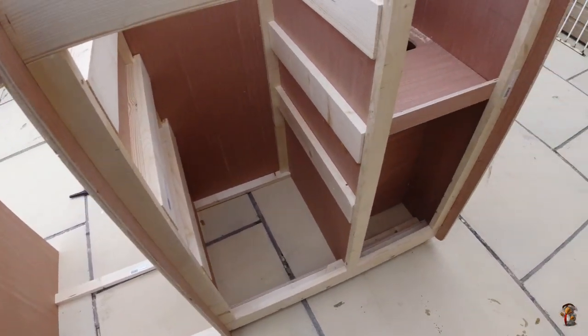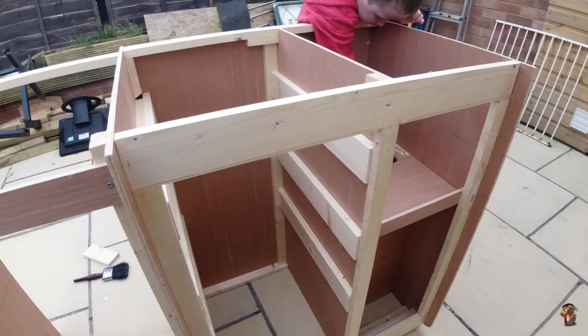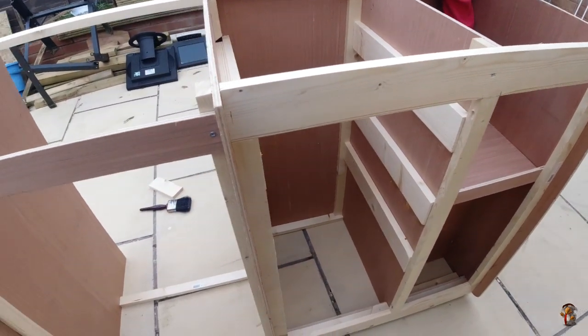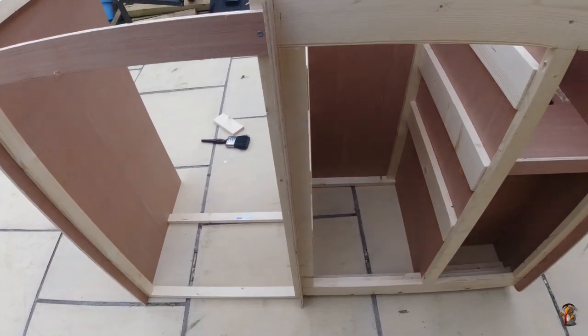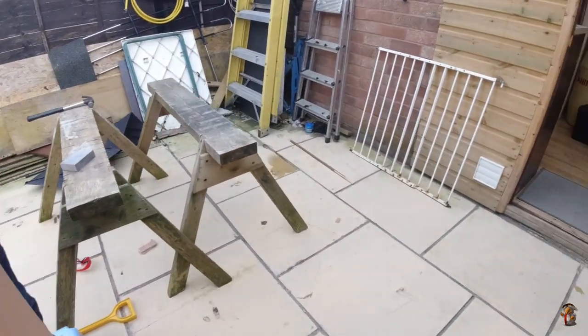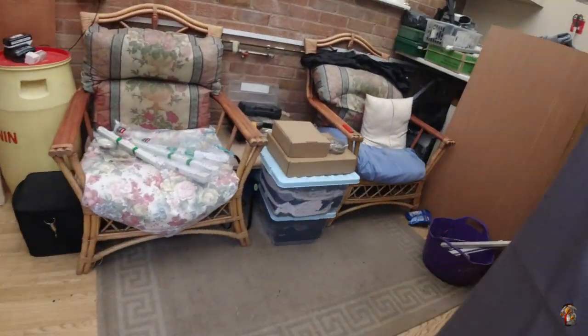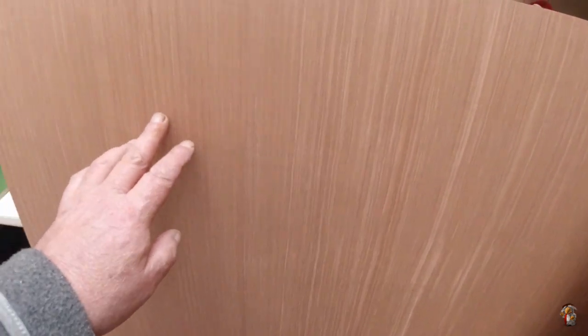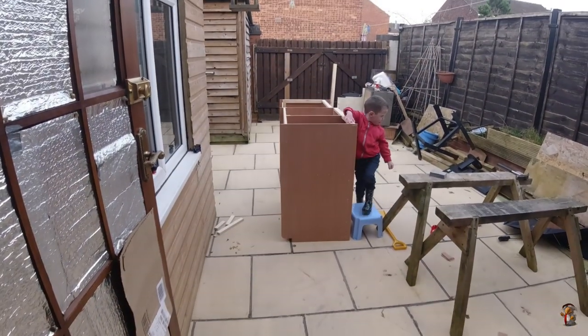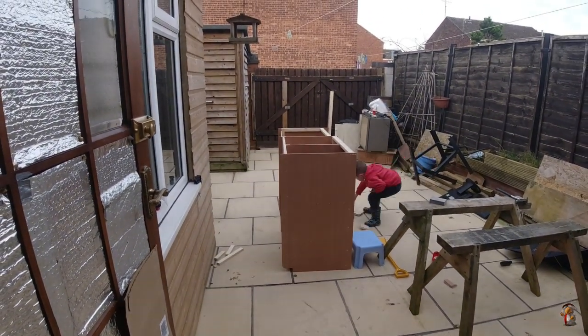That's all done, so I can just get on and make the drawers now. Must remember there's got to be half-inch clearance either side — I always forget that and then have to alter them. I've got one big piece of ply left which will cut all the drawer fronts and the cupboard door so they all match in grain.